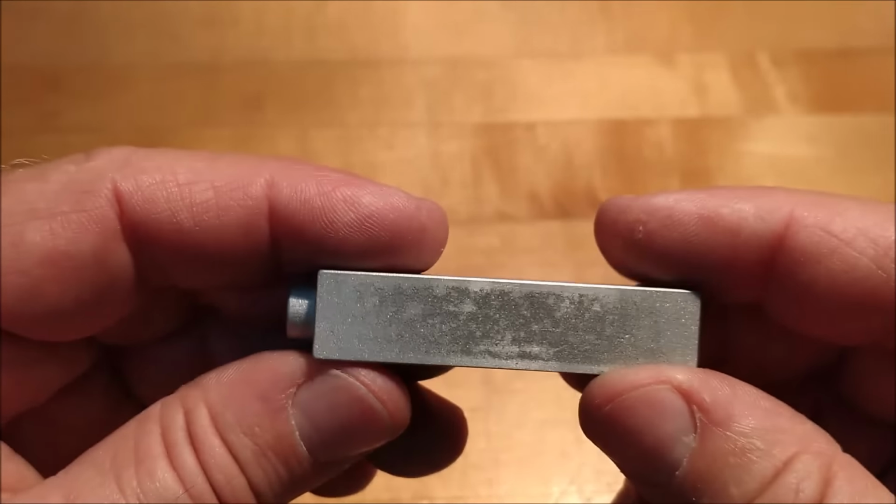Dimensions not critical, but fragile. The 125 typical is to the center of the slot on either end. The slot is called out as 1/8 of an inch wide. Now that really doesn't matter right here, so long as whatever T-nut you decide to make will fit in there. As you slide it all the way to the end, you need to be able to lift it out. So if you have a 135 long T-nut and this is only 125, well, guess what? It's not going in, it's not coming out. And if it didn't go in, then it wouldn't have to worry about coming out. All right, now that we got that worked out,